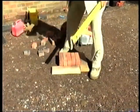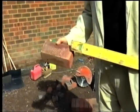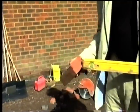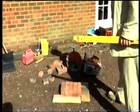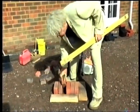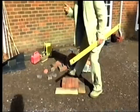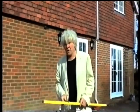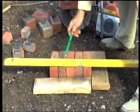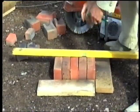On a lot of these stocks, they've got one good end — the header — and the other end's always a little bit, you know, rough. You'll always see it. So, as much as possible, if you're doing a corner, keep that end on the end, not the other, because it's got a bevel there. When you're cutting three-quarters, put that good end there. So we're going to cut the rough end off. A level is actually the right sort of width to get a three-quarter. What you don't do is cut this one because you're going to lose your good edge. Cut this end and get rid of that bevel. So we just put it down there.